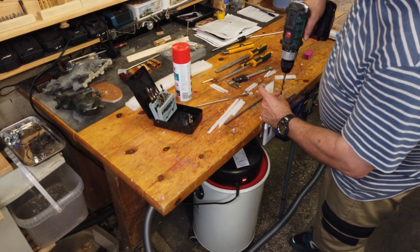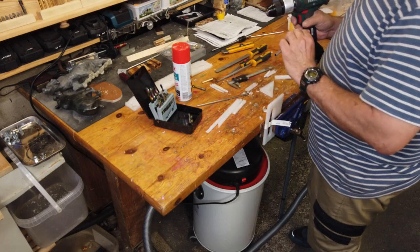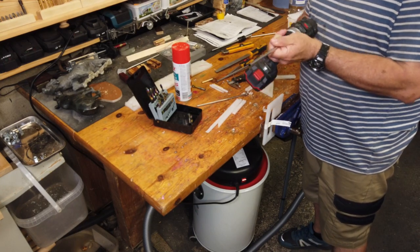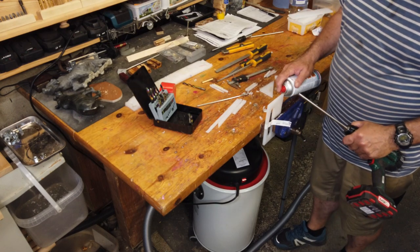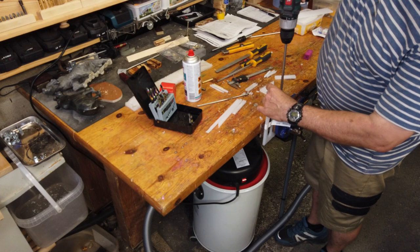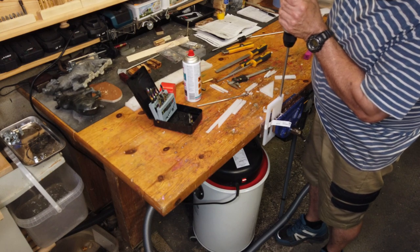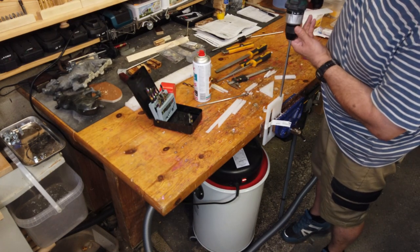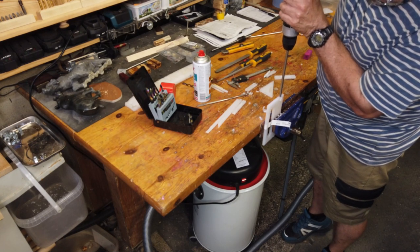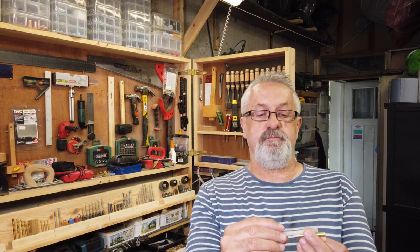That's the pilot hole done — let's do just another one, nice in the center. Take the prepared straw, which is now your hole saw. Take a bit of silicone oil, put it on the inside and just in your pilot hole, and then you start drilling. Just keep lubricating and keep cutting until it's long enough — your brass tube length plus an extra bit for your handle.